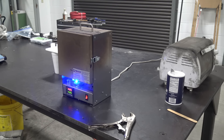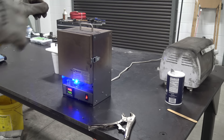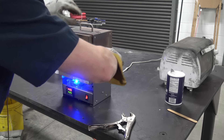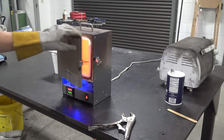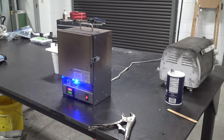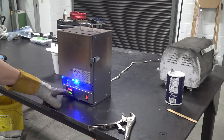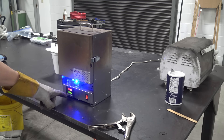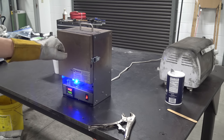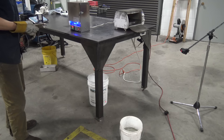We're just about done. You're not really supposed to open the oven, but because this is a fun video, let's take a look. One of the instructions is to make sure the part matches the color of the oven. The green is the program temp and the red is the actual temp — it's pretty cool how it uses the PID to program your ramps, soaks, and target the correct temperature. Seriously, for $500, most of the stuff we heat treat is smaller than my fist anyway, so it fits in there. Let's rock and roll.